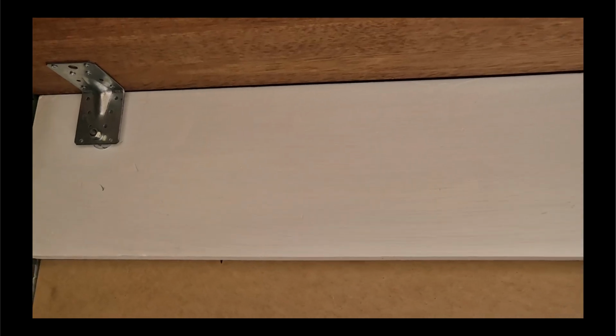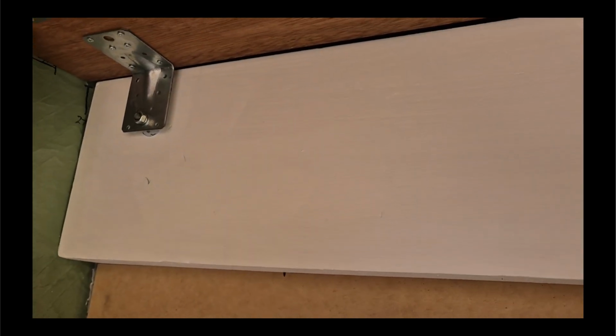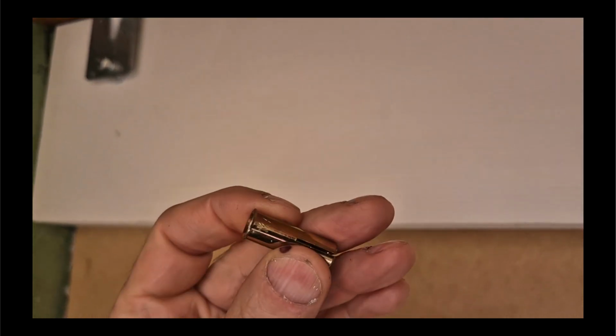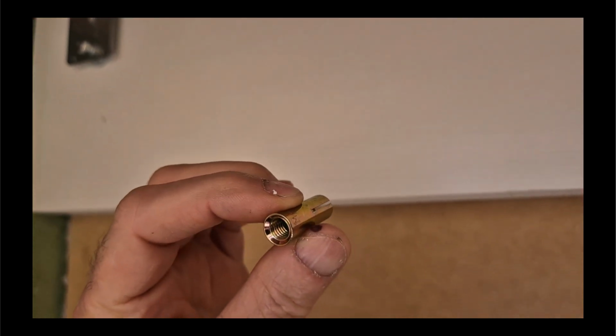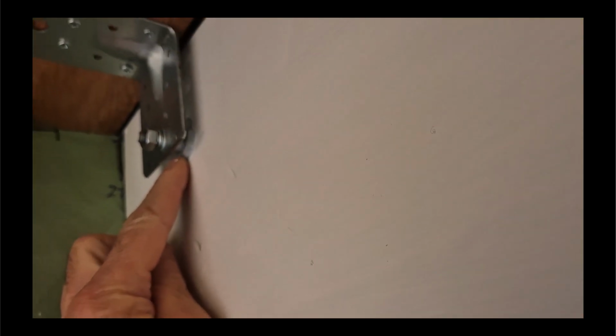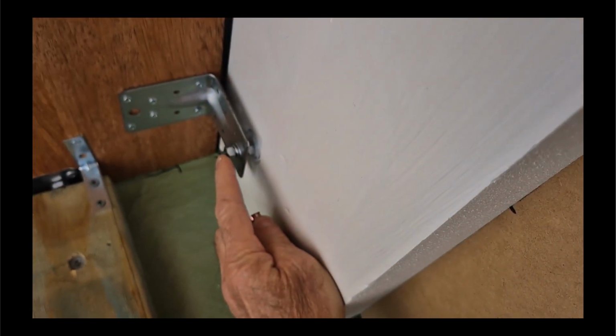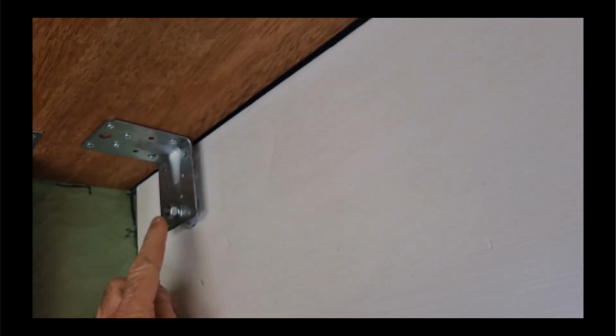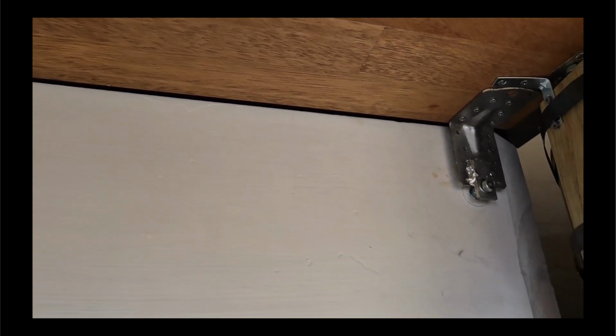So that's the last foam block installed, and the threaded rods are bolted into the wall, which has got these inserted into them. And the inner nut here is done up not too tight because it's just going against the foam, whereas the outer nut is done up quite firmly to help hold the table in against the pressure of the rubber gasket that's holding the indoor unit into the ducting.